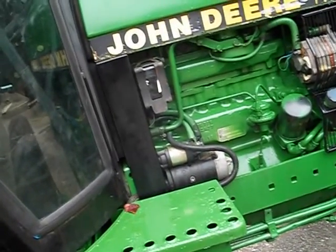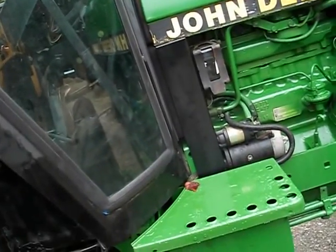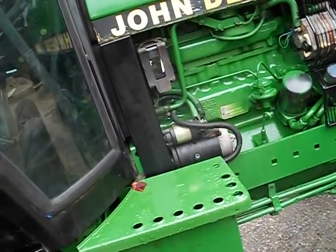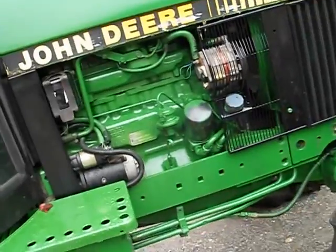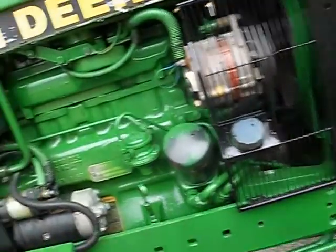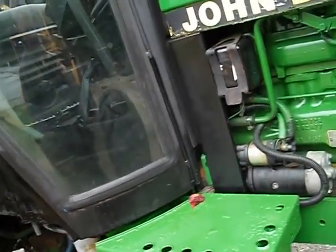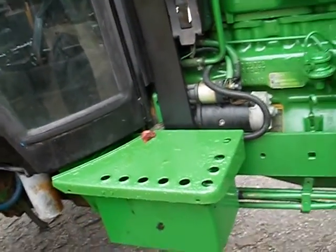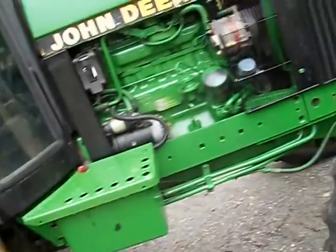After 3 hours of jiggling and pry bars and jacking one part up, one part down, and then finally deciding, okay, we're going to split it and check the pilot bearing to make sure it didn't pop out. As I got up, it went pop, and it just came together. So I think it would have been a lot easier had we had the clutch alignment tool.